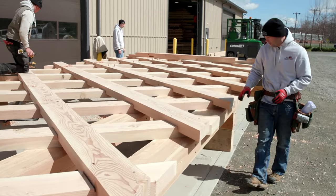This is only one of 800 covered bridges in the world. We're adding another one today, quite an historic moment. So today we're gonna be picking 41,000 pounds of lumber, and we've rigged it in 8 places with roller blocks, so it picks evenly.